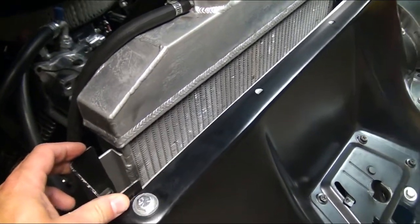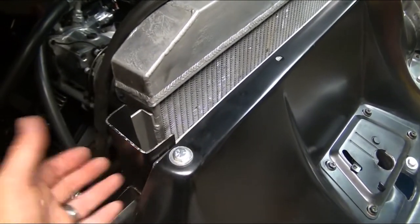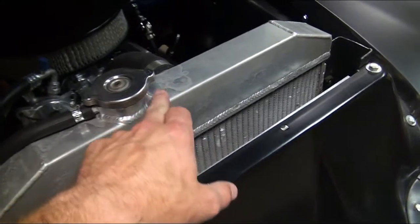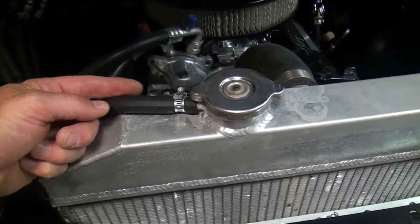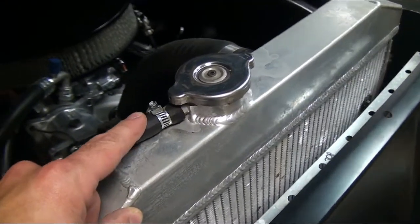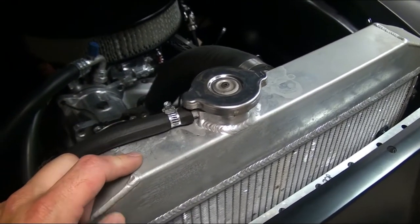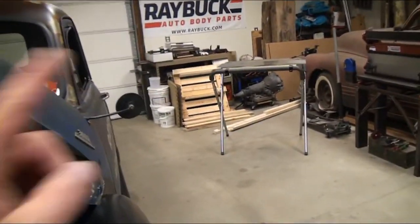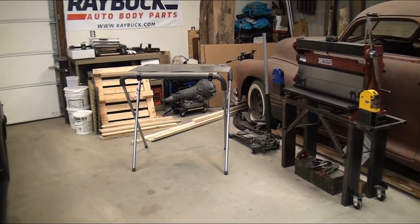It's going to be a fairly lightweight piece, so I'm not really worried about getting additional supports or bolts. If I get a couple screws in it, that'll keep it from vibrating or twisting. I think on the top I'll probably cut around the radiator cap a little bit so that it overlaps the radiator at least halfway - maybe the full way. I don't know though, because the overflow hose is in the way, so if I try to go over top of that it might actually hit the bottom of the cap and the cap might not go on properly. I'll mess around with a couple options - I'm going to get started here in just a little bit, I'll show you guys what I do with the sheet metal with the brake and bending up some pieces, speed it up, and then we'll see how this thing turns out.